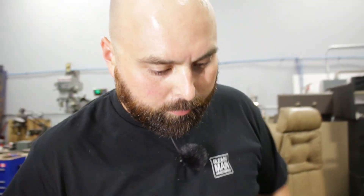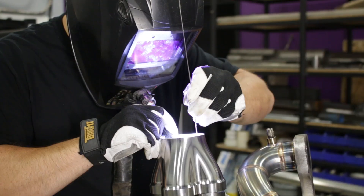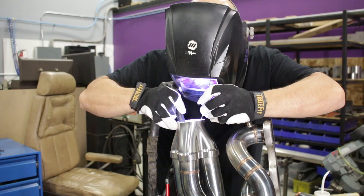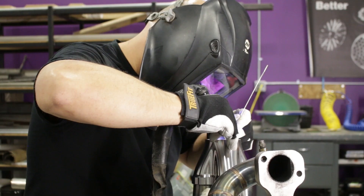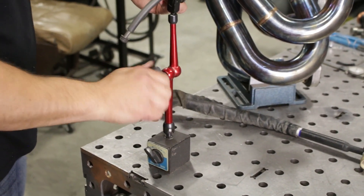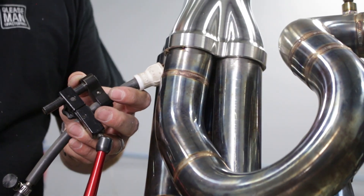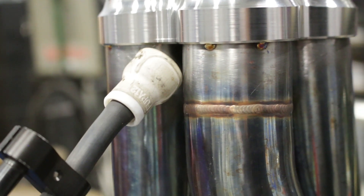What you see me doing here is welding up the inside of the collector by putting the torch right inside and welding the four ends of the star on the inside. You don't typically have to do it this way, but as I mentioned I kind of screwed up the first one by not recessing that star by about a quarter inch, so I'm just going to make my life a little easier and add some certainty to these things sealing up perfectly by welding the inside. I'm also using this little back purging tool — it's got a ceramic cup on the end on a manipulatable arm — that allows me to put backing gas wherever I need it, just putting it in the corners because I'm using a lot of amps on the inside to seal it up and I want to make sure it doesn't blow through and sugar on the backside.